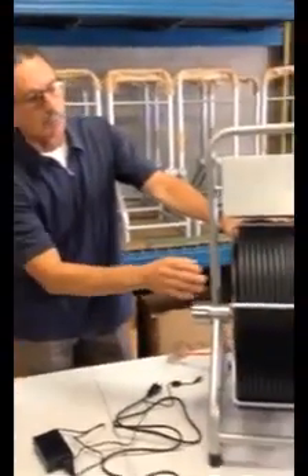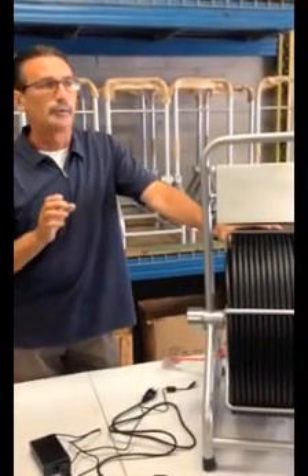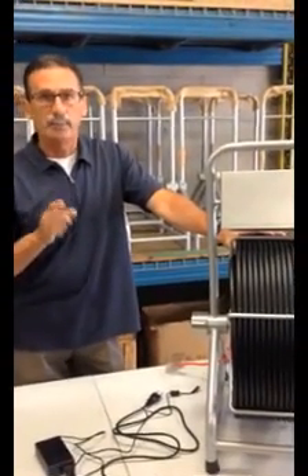It's never to be used in a 2-inch line. If you get into too small of a line, you're going to have a chance of breaking the push cable, and when you do that, you're going to lose your picture — and it's a very expensive repair. So a key thing to remember when using this equipment is 3-inch diameter and up.